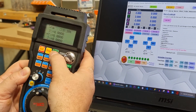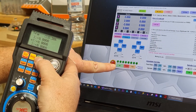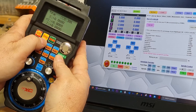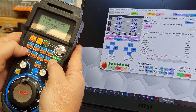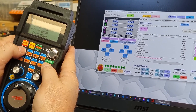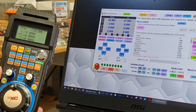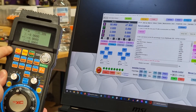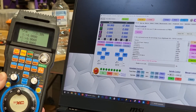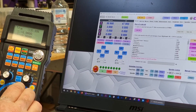You also have a Reset button, a Stop button, and a Start/Pause button. If we hit Start/Pause we go into a hold status; hit it again and we resume. If you're in the middle of running a macro, hit Stop — after triggering function plus macro one and then hitting Stop, it issues an e-stop and puts us in an alarm state. To get out of the alarm state, just hit the Reset button, which simulates the unlock function. We're now back into a normal condition and can jog the machine.